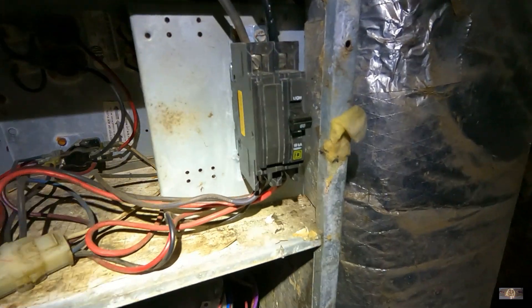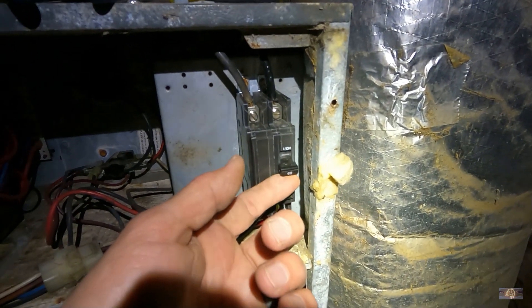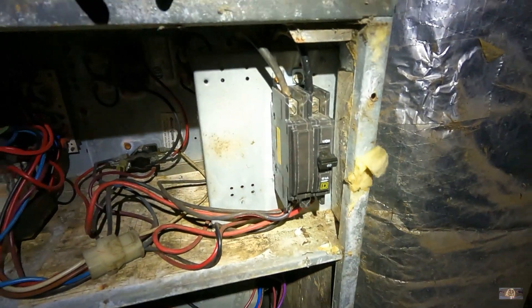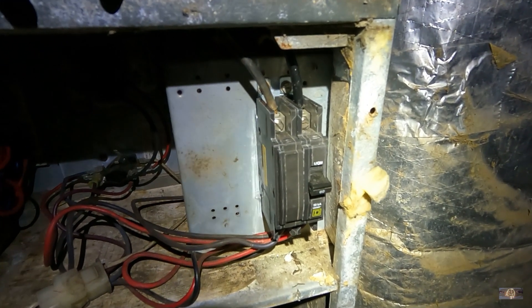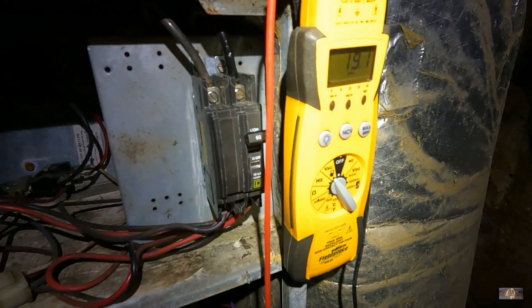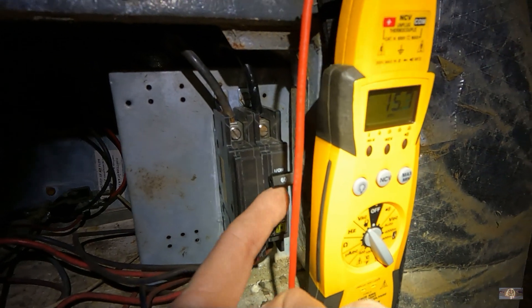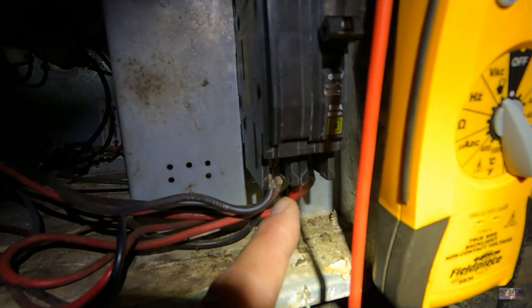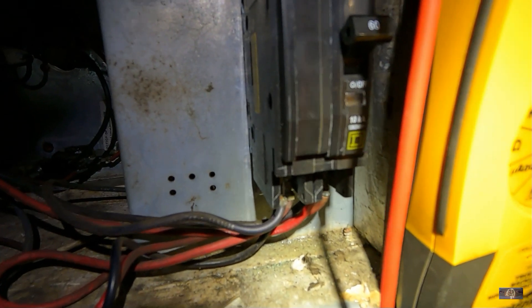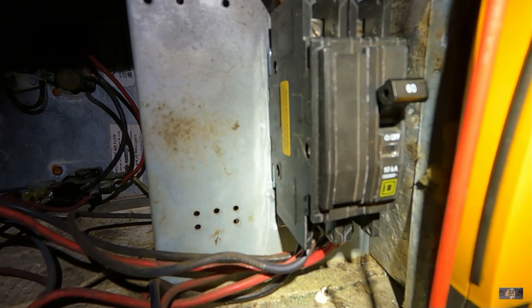I think what I'm going to do is restore power over at the breaker panel — it's next to the water heater that is spraying water. Make sure I have high voltage here, then flip this on, make sure I have high voltage passing through it, and then the thermostat should start sending a call for heat. It's probably going to go into a time delay, but we'll make sure this thing is functioning. I restored power at the breaker panel, tested voltage — had 248 volts. Kicked the power on here, and right about the time I got my test probes down there, the unit went ahead and kicked on. No time delay. Had 248 here at the bottom. Outdoor unit's running, indoor unit's running, and it smells like the heat strips are running too. So I'm going to do an amp draw on the heat strips to make sure they are functioning.